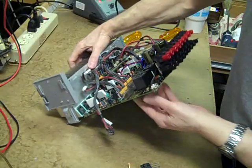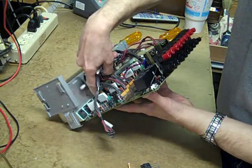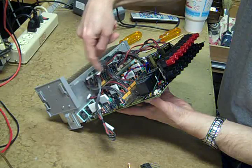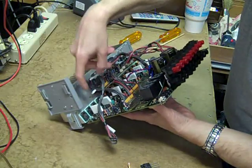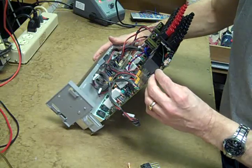I like to visually confirm that my PNP and NPN transistors are in the same order as the channel next to it — or in some cases they're mirror imaged — but I like to confirm which is which. You wouldn't want to get that reversed; bad things would happen.